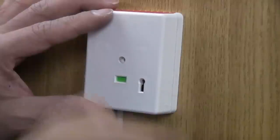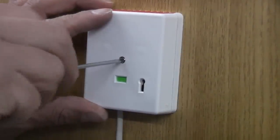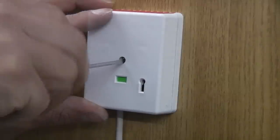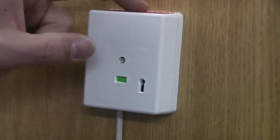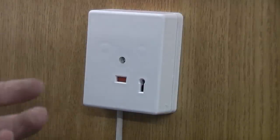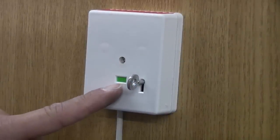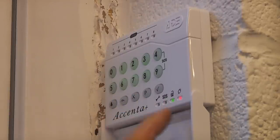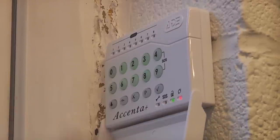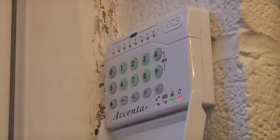Now we just need to replace the front cover — place the screw in and tighten that up. This won't actually work yet because the alarm is still in the engineering mode. Once it's been put into normal operating mode, if you press that down the alarm will sound. To reset it you need to push the key in all the way and turn it until the flag goes green, then reset your alarm panel. I'm now going to exit the engineering mode by pressing the X button. You can see the unlocked alarm indicator and power symbol are on. If you were now to press the PA button the alarm would sound. You can also use the SOS function on the keypad by pressing 4 and 9 together — that does the same thing as pressing the PA button.